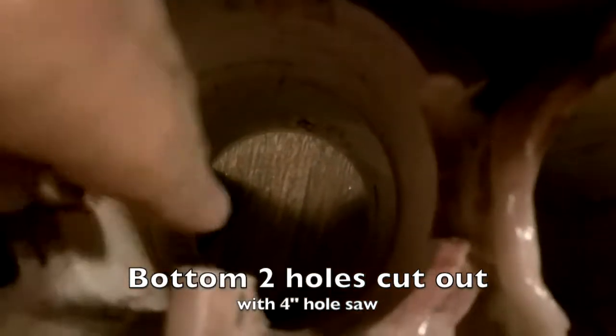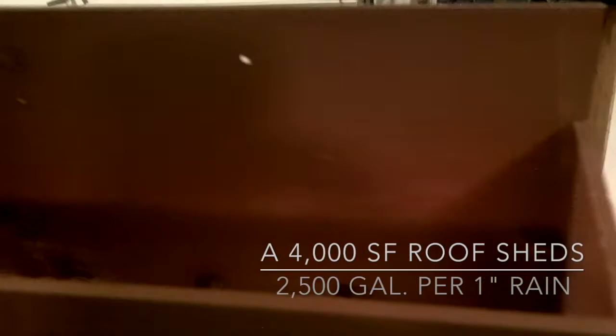Once it gets there, as you see in the middle here, drop down, go down and be filtered. This 4 inch pipe goes down to the first flush filter — that's just going to take the first bit of water coming down, drop it down, and we filter it out. We can modify it here, unscrew this piece. We got an opening at the bottom to run straight down, or unscrew this and fill up as big of a first flush device as we need. For this area, 50 gallons would be ideal. We're getting about 4,000 square feet of roof coming down to this downspout potentially. So plan for the max — once it fills that up, it will back up and overflow and all of it will go down this 4 inch pipe to a 1,000 gallon cistern underneath the goat pen.